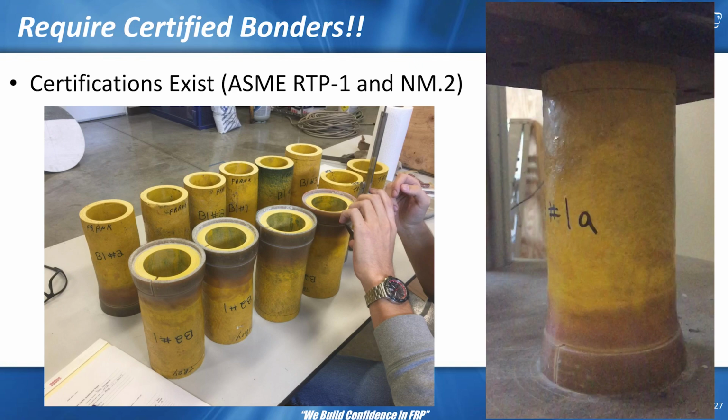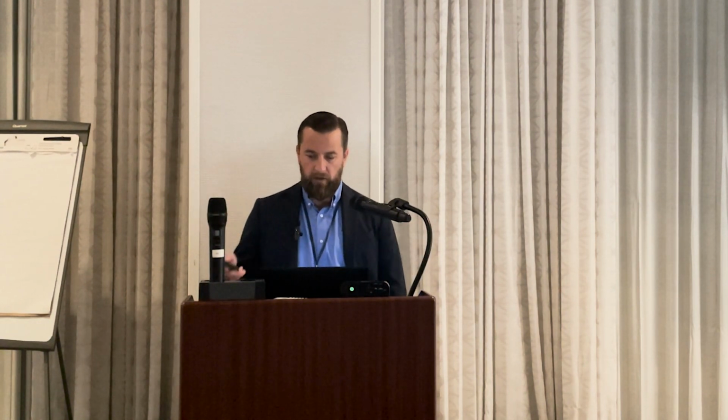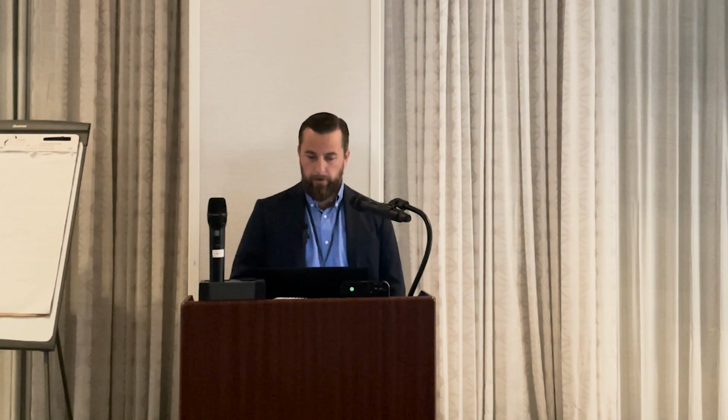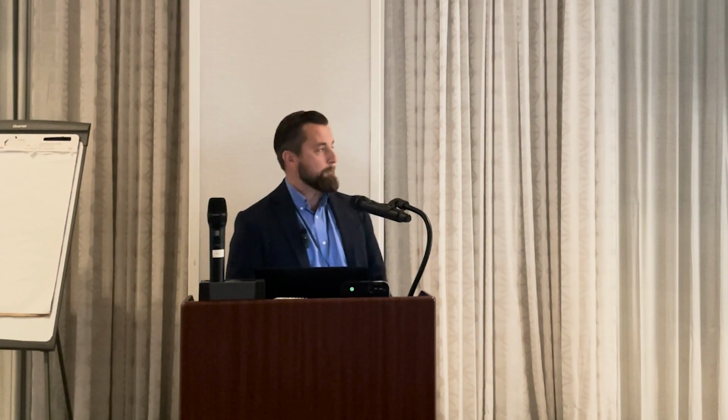Again, certifications exist. Not everyone is aware. I just had this conversation with somebody last week. When I told them about bonder certifications per ASME RTP-1, they're like, what? There is such a thing? Yes, they exist in RTP-1 for tanks and NM2 for pipe. You can do it for laminators, you can do it for bonders, you can do it for thermoplastic welders. This is the actual step of certifying bonders per RTP-1.